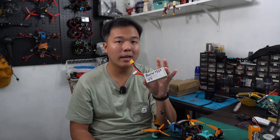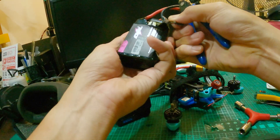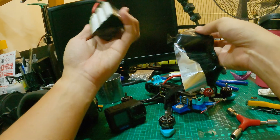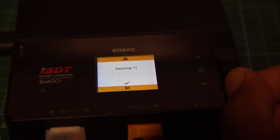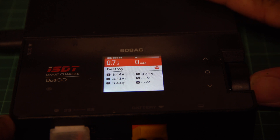Once it's presumably dry, you can plug in your battery and test if it still works. Next, for the LiPo: dry it as much as you can. The best way is to cut open the skin of the LiPo and expose the cells so it can dry fully, because if you don't, water may still accumulate inside. If using a hair dryer, don't use too high a heat — LiPos are very sensitive to heat. If you don't want to deal with the stress, just destroy it via discharge; your balance charger should be able to bring a LiPo down to zero volts so you can dispose of it responsibly.